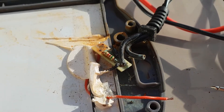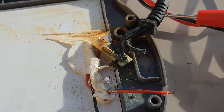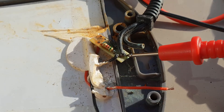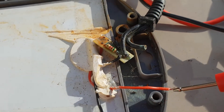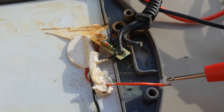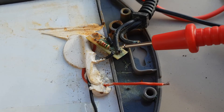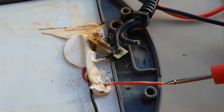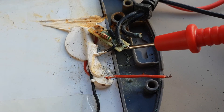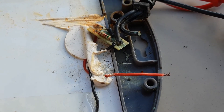To fix this, we don't really need this PCB — it's just junk. I've checked the solar panel by connecting a voltmeter to the positive and negative, and it works absolutely perfectly, outputting about 16 volts. All we need to do is connect a new diode facing the correct way — the line on the outer side acts like a wall, stopping current coming back in. Then on the negative side, straight to the negative of the lead, take a feed through a new resistor to the LED, with the other leg back to the negative terminal. Then seal it all back up with hot glue.